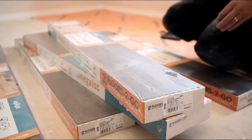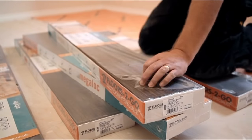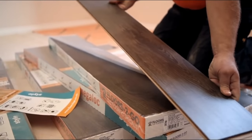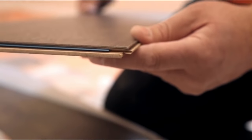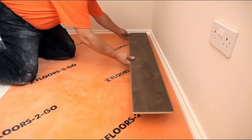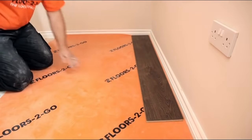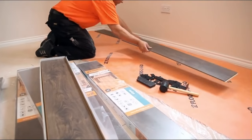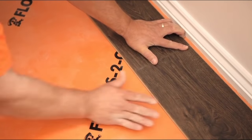We're good to go, so let's start fitting. Get your first piece out and check it over — it's a good idea to do this for every piece as you go. You'll see that one side has a tongue and the other a groove. Lay it down working from the left-hand corner of the room with the tongue facing the wall. We're going to work across in rows, but never in columns. Now take another piece, attach it to the first, line up the two boards, put the tongue into the groove and slide them into place.